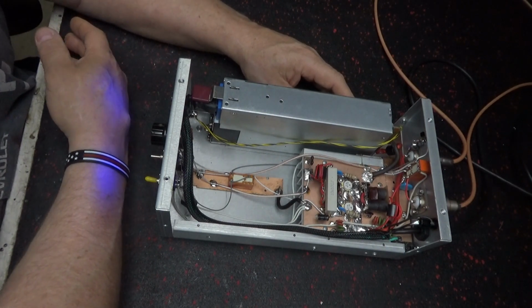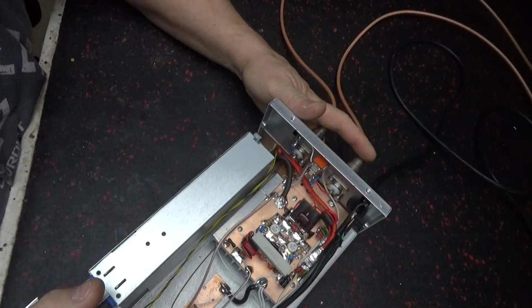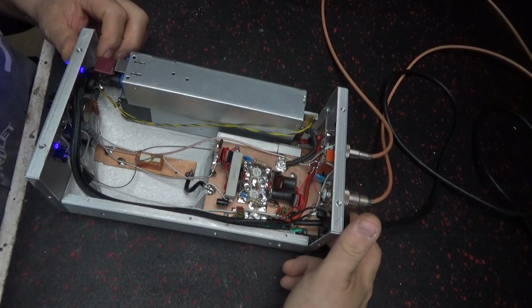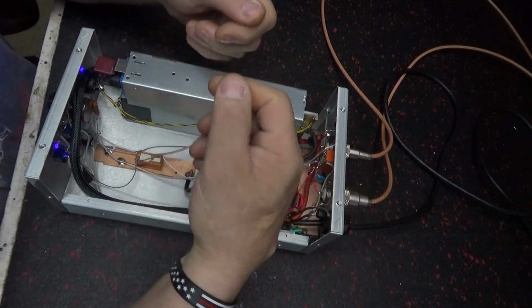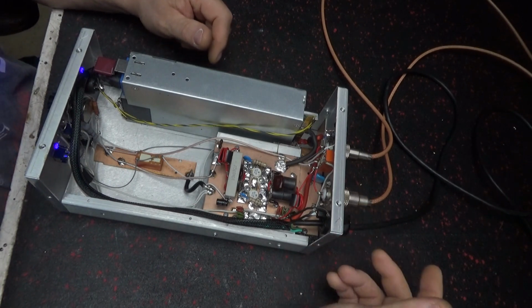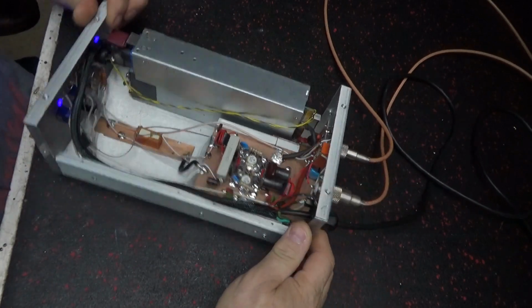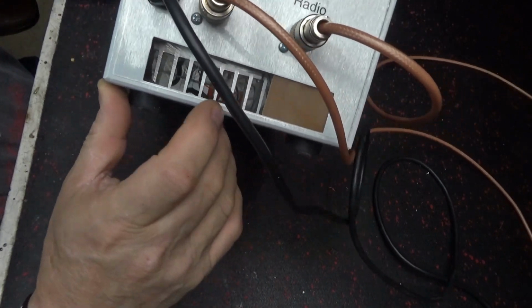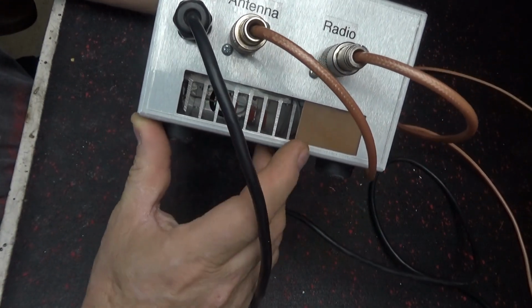But anyways, I done a block off plate back there. It had a big old gaping hole over there. I think I showed that, and it had a gaping hole over here. So I took some of that modeling foam. You could take apart layers and stuff, but I took that and pushed it up inside there, and that'll hold. The air's got to flow through the heat sink, and it's going to do it now. Got a nice block off plate there. It's blocked off over here in the corner.